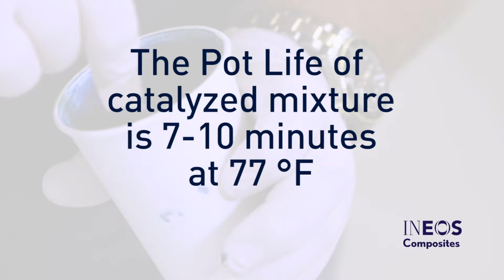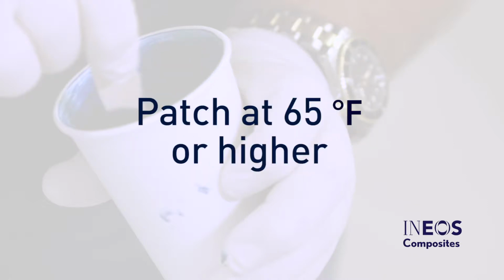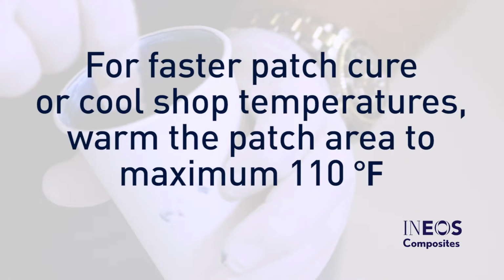The pot life of the catalyzed patching mixture is roughly 7 to 10 minutes at 77 degrees Fahrenheit. You should patch at 65 degrees Fahrenheit or above. If faster patch cure is needed, or cool shop temperatures necessitate, warm the patch area to a maximum of 110 degrees Fahrenheit. It will be slightly warm to the touch.